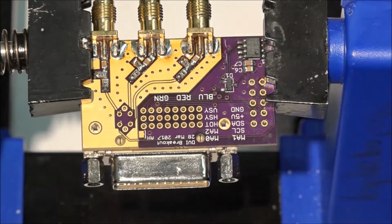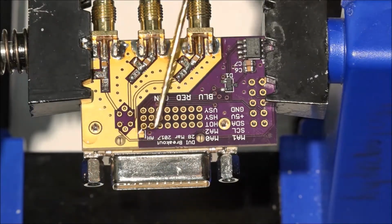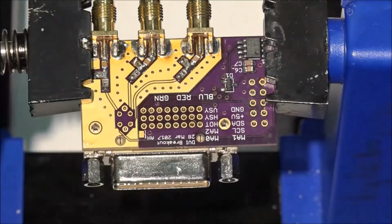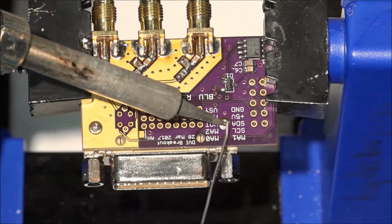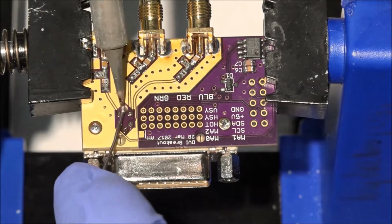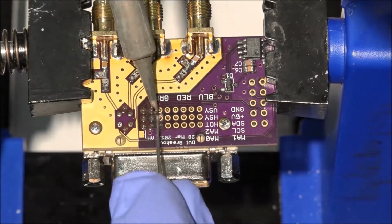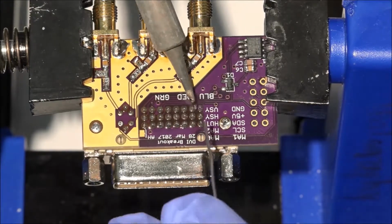We'll start soldering by putting flux over all of the pins, then soldering the structural anchors. These large holes should be filled with solder but not overflowing. Then go around and give a little bit of solder to each of the pins. The ones attached to ground need special attention because they need more heat to warm up. All of them should have a shallow concave solder surface and should not bead up.